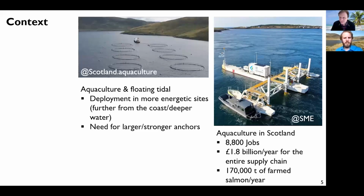Can this be used for soils? I guess if the soil is hard enough, it might be a possibility. Yes, maybe, I don't know. I have some doubts about this, because if you imagine a soil, I think with this failure mechanism, very fast, you will just pull the anchor out with a tiny layer of soil on the side, because for a soil you would need really a plate or to mobilize something. With this just slightly inclined truncated cone base, I don't think you will mobilize much resistance, but I'm not sure, so I wouldn't be definitive about it.